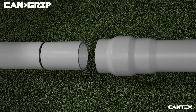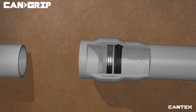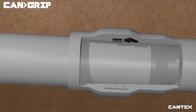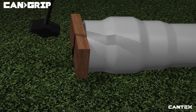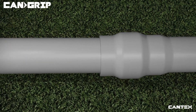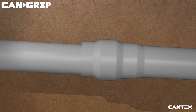In a league of its own, CanGrip delivers the easiest and fastest installation of any horizontal directional drilling conduit system available. The patented internal gripping locking mechanism and pre-lubricated gasket do all the work, so CanGrip sections connect in one fast step. Just push the plain end into the CanGrip bell end and hit the bell end with the board and mallet until it reaches the line and is fully inserted and secure. No cement or external locking mechanisms are needed. Simply repeat the process until all sections are connected and ready to pull.